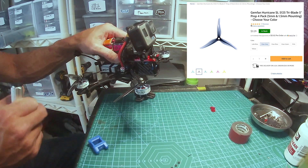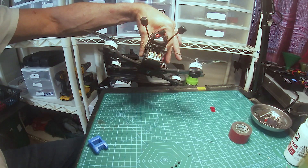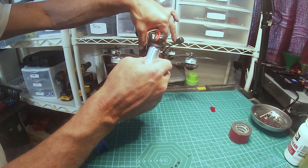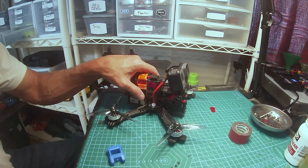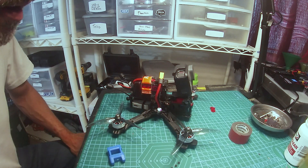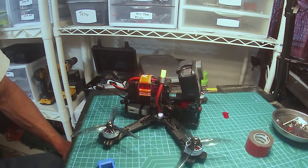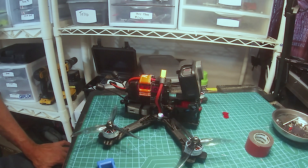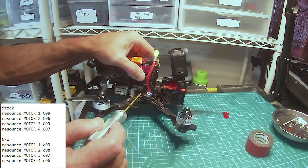I bought some five-inch props. For the antennas, since I didn't have a mount, I tie-wrapped them to the standoffs — I kind of like how that comes out, although they could get caught in the props in a crash. I've got a 1500 milliamp battery and the GoPro Hero 6 set up and ready to go. I don't have any ND filter, so the shutter speed is just going to be on auto at 60 frames per second. White balance is set around 5000K.